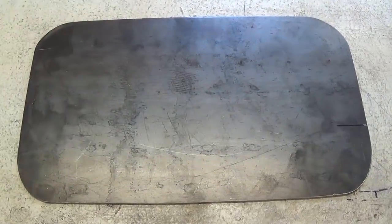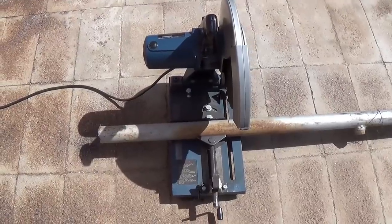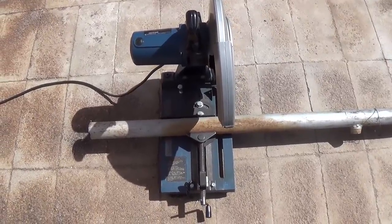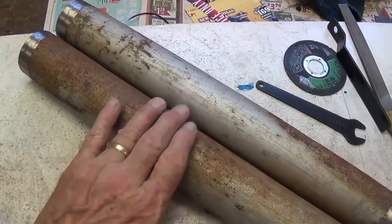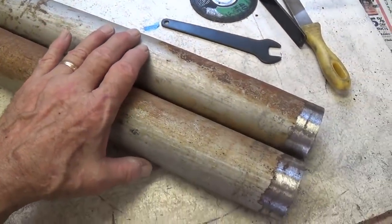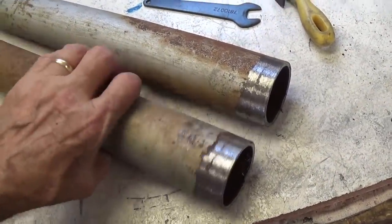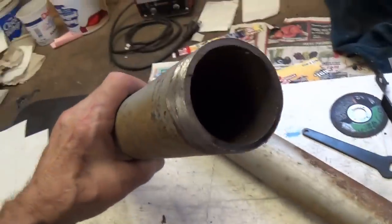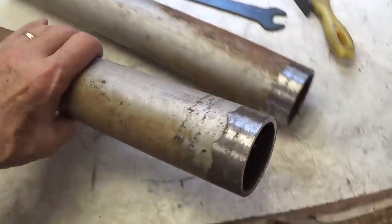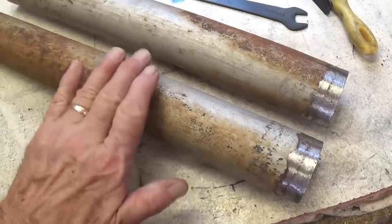Next, it's time to cut out the legs. When cutting heavy pipe like this that has to have perfectly square ends, a chop saw is always the best — it aligns the pipe and cuts a perfect vertical cut. Now we have two identical length, perfectly square cut, 18-inch pipe legs. The ends have been ground down to bare metal to facilitate welding. This is good stout pipe, probably 3/16 or a quarter inch. It's heavy, but we want the weight down low, so this is actually ideal material.